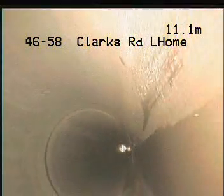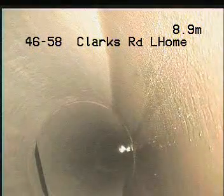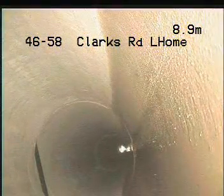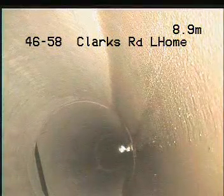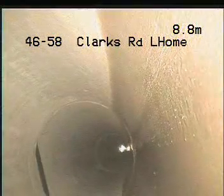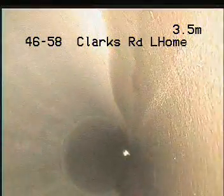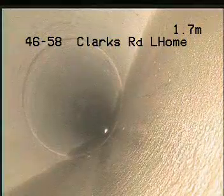Just retrieve and continue — the ring joins hold there. At 8.9 meters you can see another ring join is actually ajar. This ring join can suck in water. At 8.9 up the line you can see the large black rubber ring at the bottom left of the screen. There are a few problems above and below this manhole.